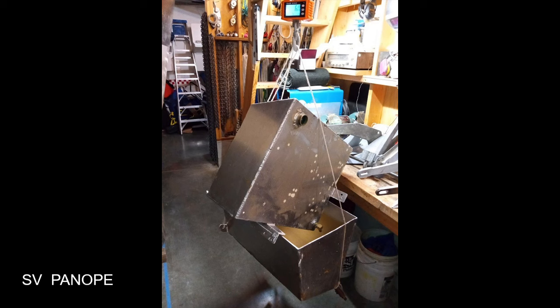That is the only effect that the diesel had on this tank after more than 20 years of fuel being in there. The bottom of these tanks is shaped like a V, and the fuel pickup is right at the very bottom of the tank, so the fuel would just gravity right out of there, along with any water that collected. Water would immediately just end up in the filters, and what it meant was no diesel bug, no rotting carcasses, no black sludge, and no corrosion.